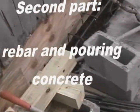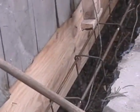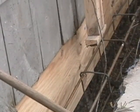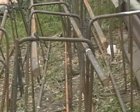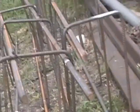You can see what we've done here - we've got the steel in there. We got that 5/8" rebar and then the 3/8" for stirrups to kind of hold everything in place, and same thing on this side all the way down. With a 12-inch wide trench, our steel is 8 inches apart, and since we're going 24 inches deep, the height of it is 18 inches.